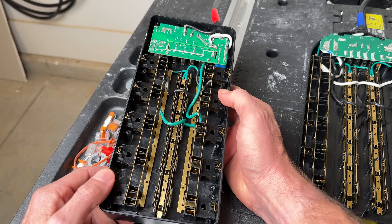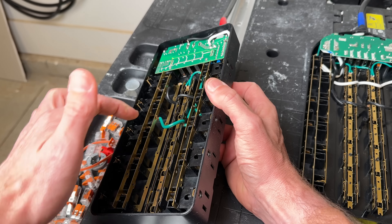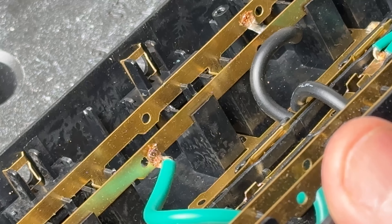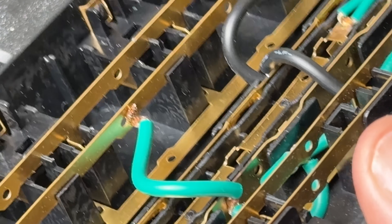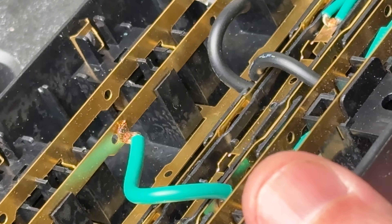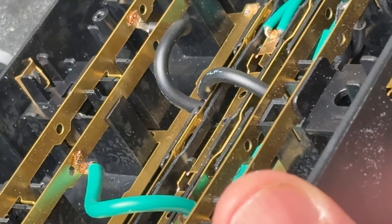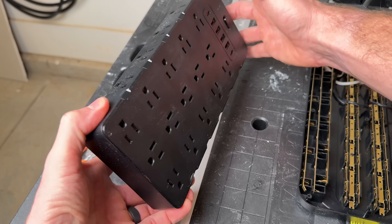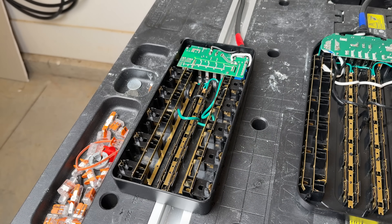That's not best practice. The other ones actually don't do that, which is a little more encouraging. Let's look close at the solder joints here — you can see how they soldered from a bus bar wire to connect things up. Not loving that. You'd think there's some resistance there and definitely some opportunity for failure with such a weak solder. It's a unique overall design, but the internals are not encouraging.